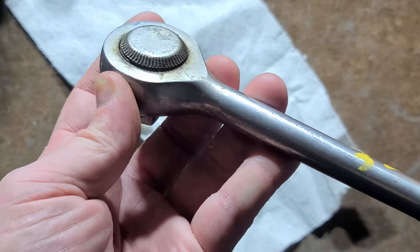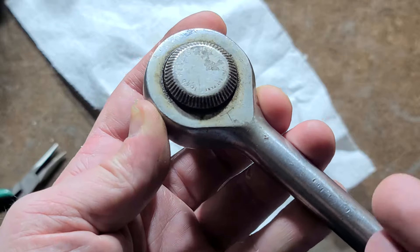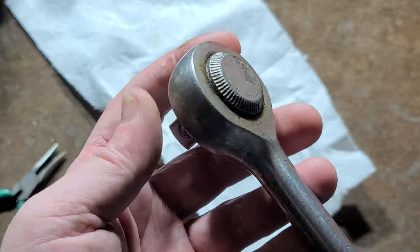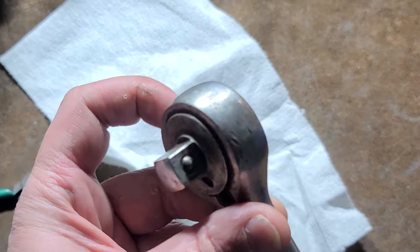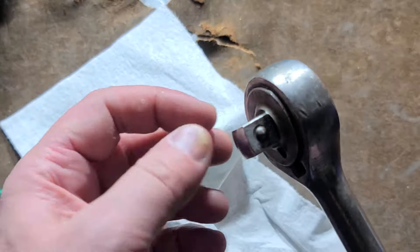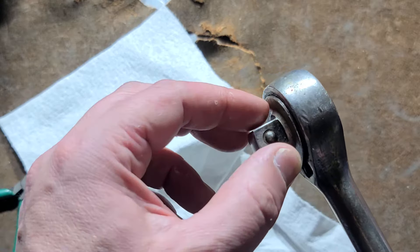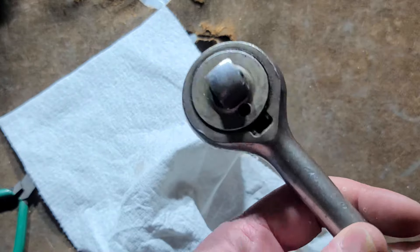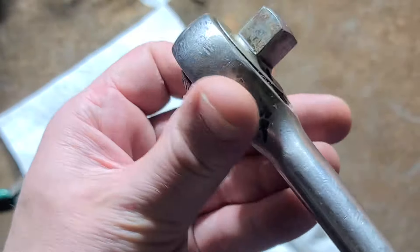I reviewed, maybe three years ago, a Pennins half-inch ratchet, a 1660 — the newer version, same model — and it had a giant reverse switch on it. It was like a 24 or 32 tooth. Tearing it apart, it was just a real disappointment because it was a swing pawl, SK style, single pawl — a single rocking pawl instead of two, and it had a single tooth. So I'm seeing if this one's any better. You can see by the hole right there, I think this is just going to be a single pawl.